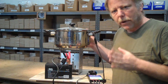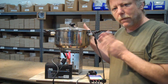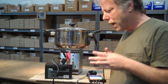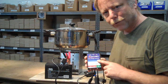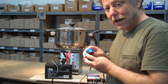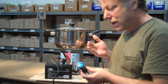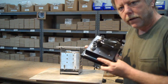One of the things I really like about the pot charger is you have access to the unregulated output. This particular 8-watt model outputs around 19 volts at normal operating temperature. I've rigged up a special application here where I'm able to charge a lead acid battery using a solar charge controller, with an output coming from the solar charge controller for 12-volt power, and adapters to charge USB devices as well. Whatever power I'm not using on this connector gets stored in this battery, which is a pretty cool application.